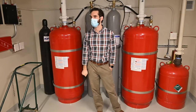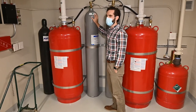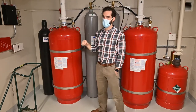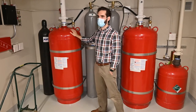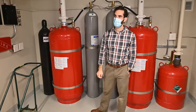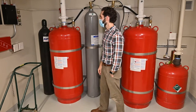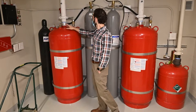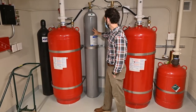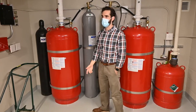What's the process for filling these back up? For these nitrogen tanks — they're 300 bar high-pressure tanks — they get taken out and brought to a place to be recharged. For the Novec tanks, we'd come in with Novec fluid tanks and pump it in. How often are the nitrogen tanks tested? I believe it's either five or ten years — it's in the O&M manual. I can get back to you on that. They may need to be brought to a facility, and the library would need to decide about replacement tanks to keep the system live.